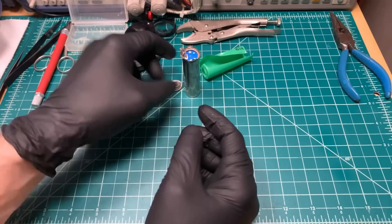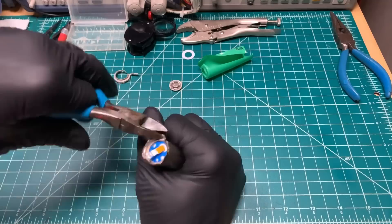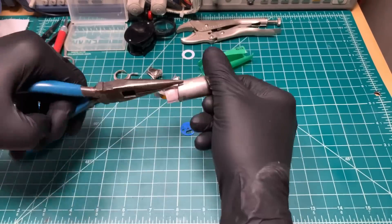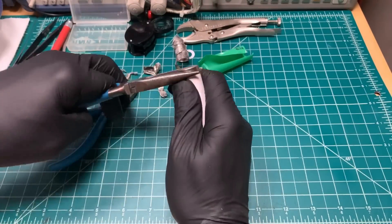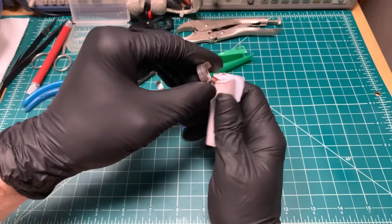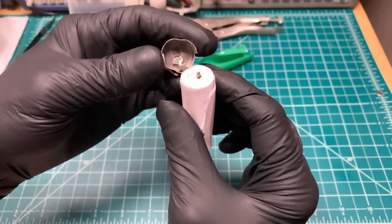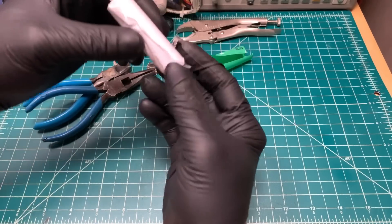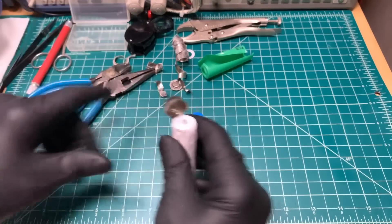This is the top part. There is the positive tab coming out of the circular roll, and we'll go down inside the rest of the battery. I didn't just pull everything out of the can because I wanted to show you what goes on down in here — that's the negative connection coming out of the spiral roll, spot welded to the inside of the can. They actually have to come with a rod down through the center of the cell and spot weld this blind, without even seeing it — done hopefully by machine, but some places do it by hand.